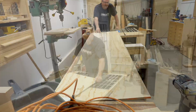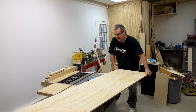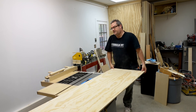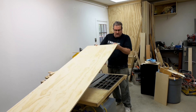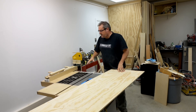You want to make sure the saw comes to a complete stop before you move the stock — that's the safest way to handle it. Don't be in any rush; there's no race to the finish here, especially if you're doing this as a hobby. Take your time and be safe. Looking at the cut, it looks pretty straight, and it will be as long as you're able to control the piece and keep it up tight against the fence.